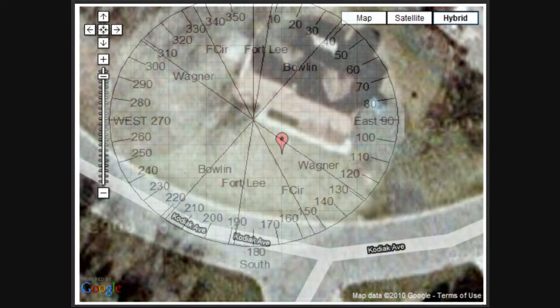So looking at this compass rose, I can figure out what direction my sidewalk angle is. The face is at 115 degrees, and my house faces 90 degrees from that, so that's got to be 205 degrees. So my panels are sitting at 205 degrees.